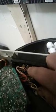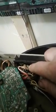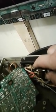If you look carefully at these controls you'll see these two potentiometer limit adjustment screws — I believe they're 10k potentiometers. A lot of times in these old electronics when you're dealing with a potentiometer issue, they have these two adjustment screws somewhere in the device and you have to find them. A lot of times manufacturers will mark them with a little line of paint so you know where the factory set point was.